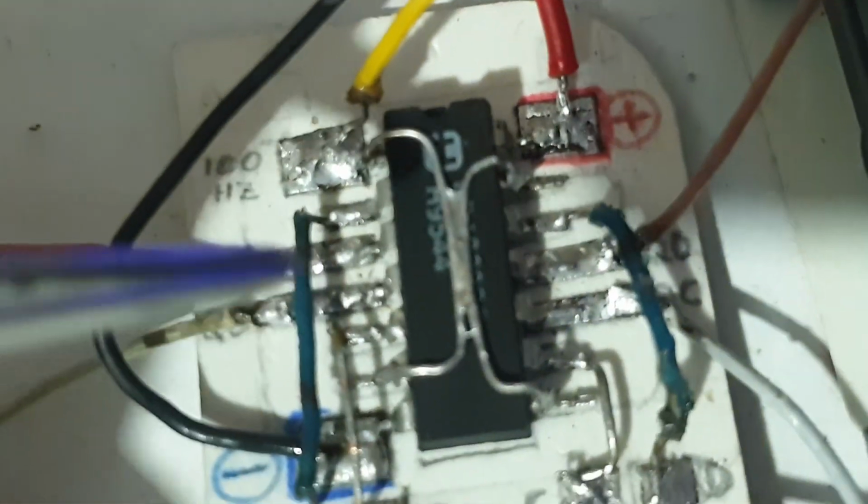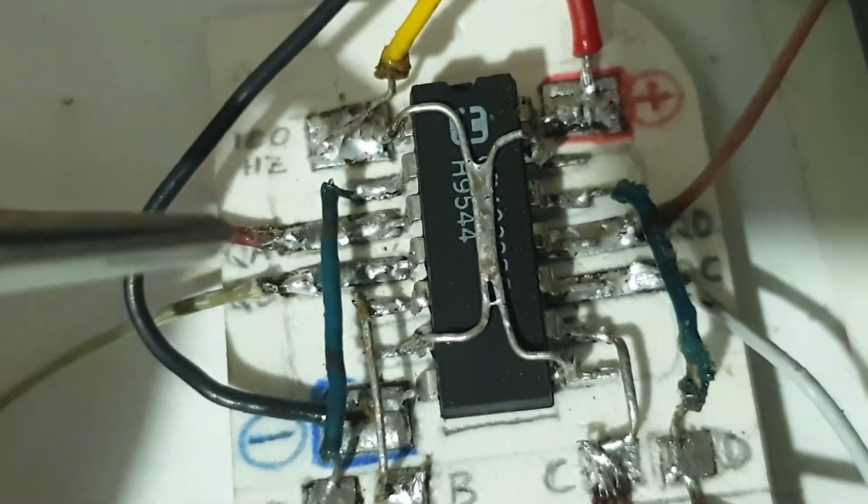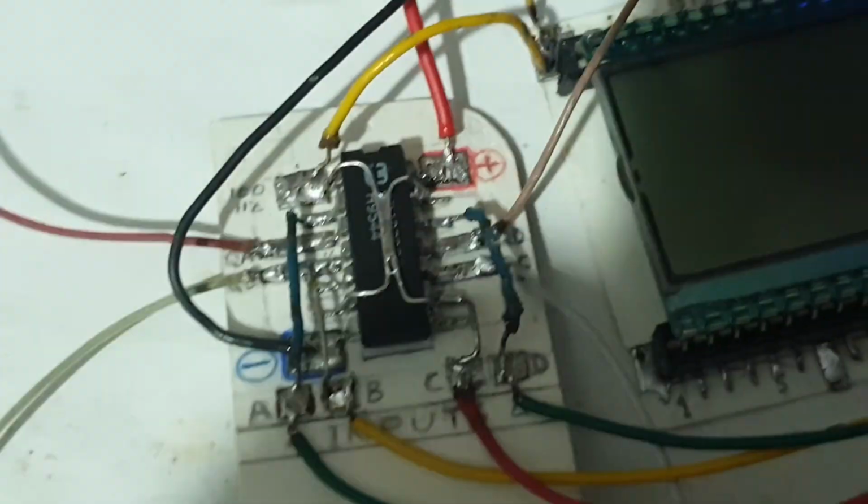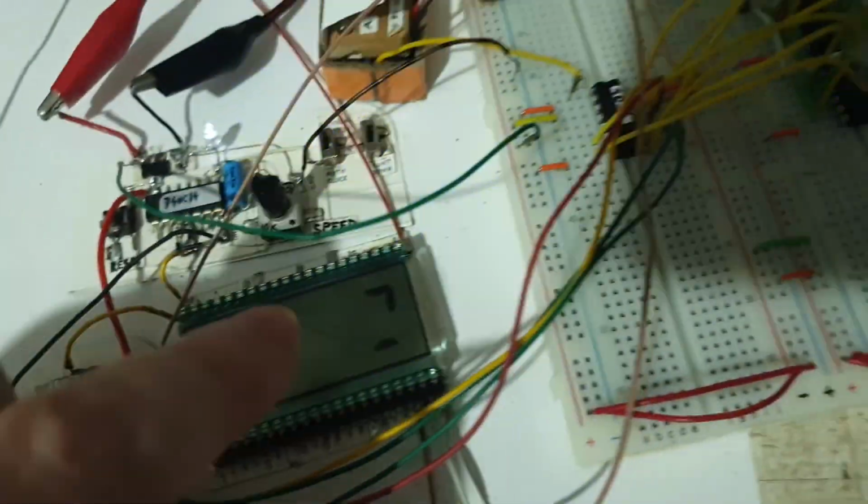And it's a good lesson for me to actually leave a blob of solder there when everything is reflowing, is getting liquid. It will still stay in place under a blob of solder. So that's the story so far. So right now it is actually working.